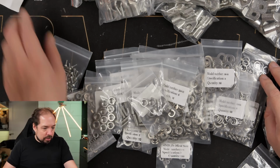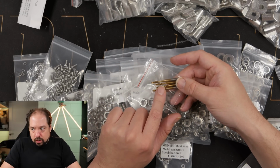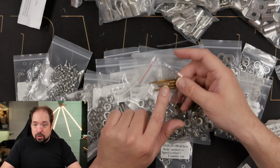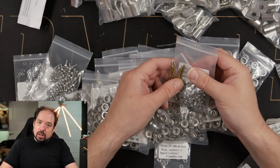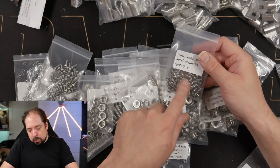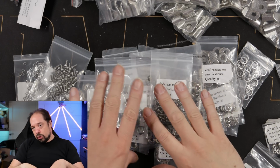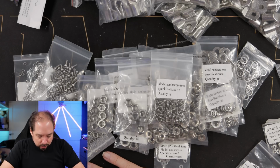So the plan is with, do I remember where I put those? Yeah. For instance, these were those screw, what do you call that? I forgot the name. Oh, they are a threading tool, so you can make thread. And they should be for M3 thread. So together with this baggie over here, which are M3 screws, I could, in theory, drill a hole in copper and then make it threaded with these, and then be able to screw a normal screw in there to attach a cable like a balance lead or something like that, which we have with the BMS we looked at the beginning. I didn't show you those, but once I took it out, you saw all those red cables there. Those are the balance leads you connect to each battery positive side so that you can read out the battery voltage.